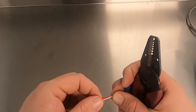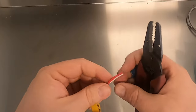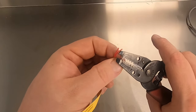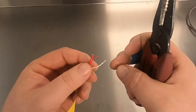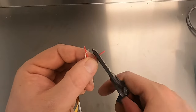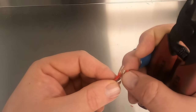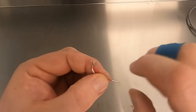You want to start by cutting all your wires the same length, so we'll straighten these out and cut them back so we can get them as long as possible for the new splice. Pay attention to the gauge — we'll use 24 gauge here on the strippers. Sometimes the insulation doesn't come off completely evenly, but it's better to go on a second take than to damage the wire strands. The 22 gauge is definitely what you want — see, that stripped it without damaging any of the wire strands. Then twist it and make sure the strands are nice and tight.